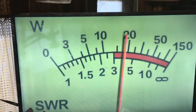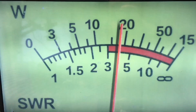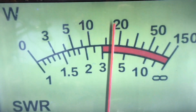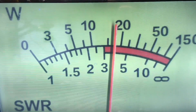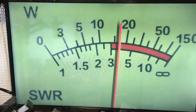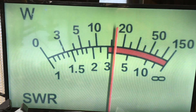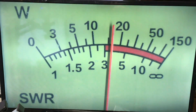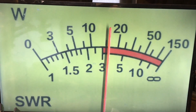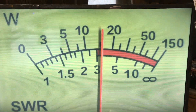Okay, it keyed up — let's hit the timer and watch that needle. We're at 10 seconds and I think it's already starting to drop. This is a two-minute key-up, one-minute-off cycle. 30 seconds — yeah, she's dropping. 45 seconds — we're only down to about 15 watts already. 50 seconds. Under a minute and we're dropping. Now we're at 60 seconds, one minute key-up, and she's already dropped down about 5 watts.